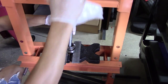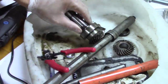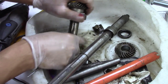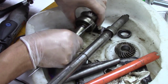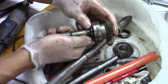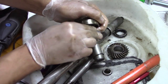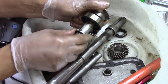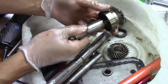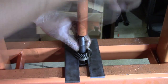Time to put the press on there — I thought it would fall off but it didn't need to be pressed off. The way I was trying to press it out, I had to remove this clip. And yes, that is blood — that sharp thing in my hand, trying to get it off, I poked myself with it and I am bleeding. Anyway, I get that off and decided maybe I'll press it out the other way. I tried smoothing out the burrs on it, but the bearing still wouldn't come off. So I realized it's going to have to be pressed out — I turned it around the other way and pressed it out the short way.